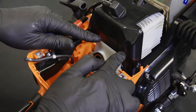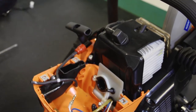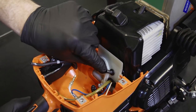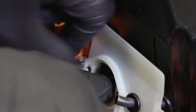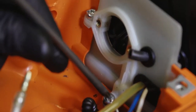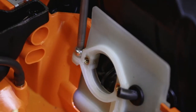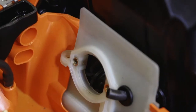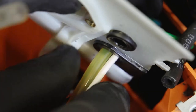Now remove the carburetor mounting flange. First take out the inlet suction tube ring. Take the suction tube, press it, and push it behind the flange. Then remove two T25 Torx screws — one here, one here. To remove the carburetor mounting flange, simply grasp it, pull it straight up, and slide the hose grommet out of the slot.